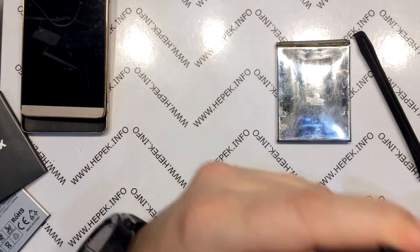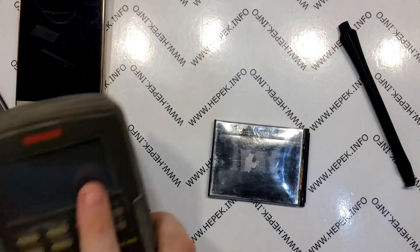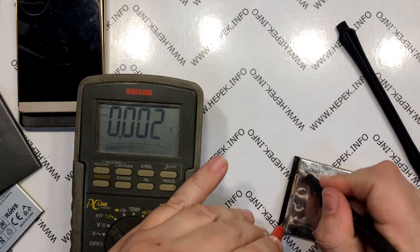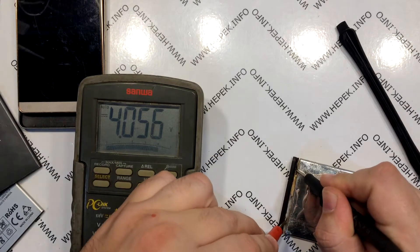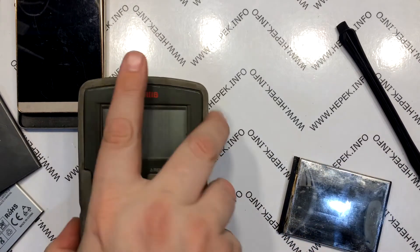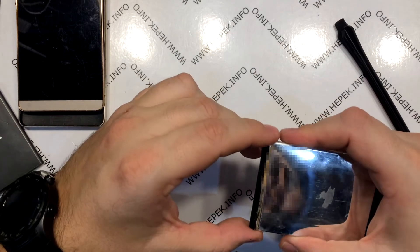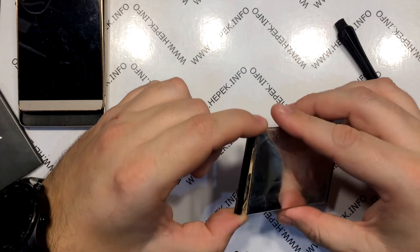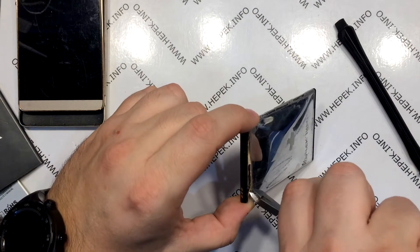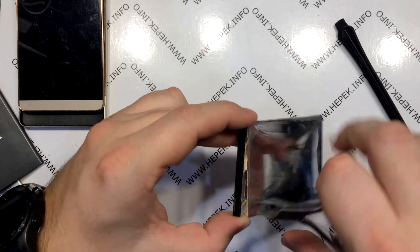I slowly disassemble the plastic from the battery once again. I assure the polarity of the contacts, then check the polarity of the terminals coming out of the cell — the left terminal on the cell is the positive one, and the right one is the negative. Since I want to use the plastic from the old battery with electronics and battery contacts, I need to separate it from the cell. I will cut the terminals exiting the cell — the lower I cut the better, because that will make the contacts stay longer on the plastic side. The cut must be made quickly because there is a high probability of short circuits between the positive and negative terminals.